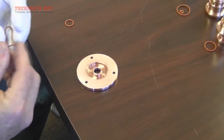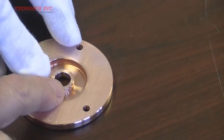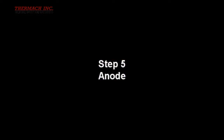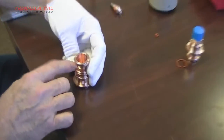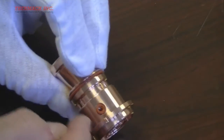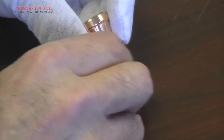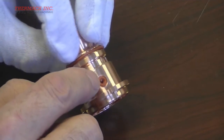The front cover will get two o-rings as well. There are three o-rings for the anode. The first goes on the outer diameter, while the two small ones go into the counter bores on the side. Note that later we will be applying lubricant to the o-rings, but not to these two small ones.